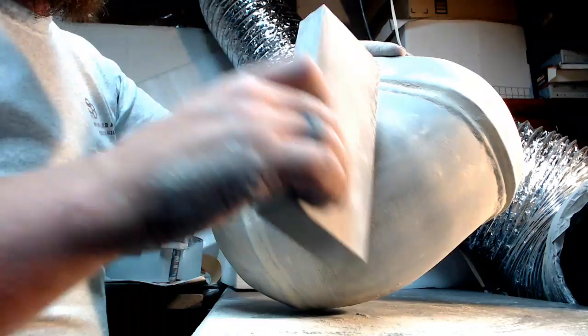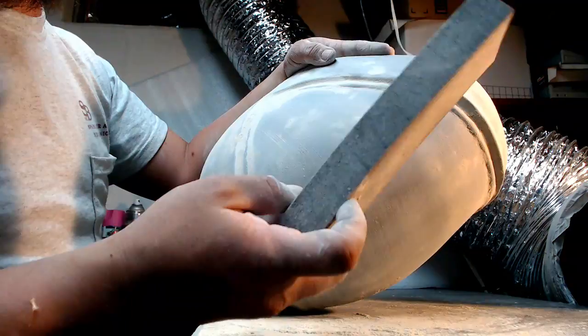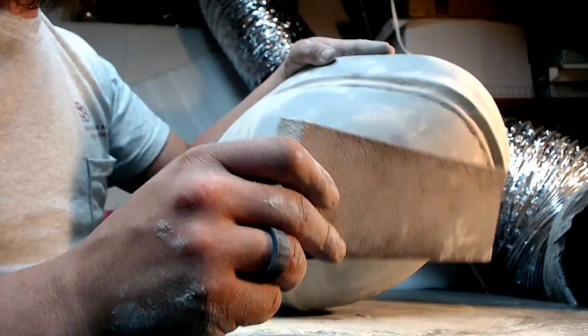Soon gonna be time to clean my sponge. All the pores are getting plugged up for the most part. There's a little bit along the edges, but I don't like using the corners because of digging into anything. This sponge, for anybody that it wasn't here when I said it before, is a drywall finishing sponge. It's 120 grit on one side, 220 on the other side, but it's a nice squishy foam block. The idea is you can wet sand with this thing. You can soak up water in the sponge and it slowly comes out through the grit.